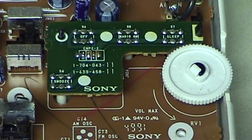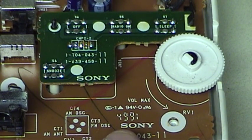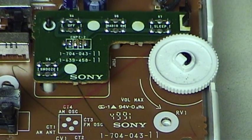You can also see a date code down here — that's the 4991. It tells us that this unit was made in the 49th week of 1991, meaning that this clock radio is probably either a late 1991 or 1992 model. Although Sony probably has the manual on their website available for download, I have not checked its copyright date to determine when this clock radio might have been marketed. Despite its age — clearly it's more than 20 years old at this point — you can see that it's still working pretty well, apart from some uneven brightness in the segments of the LED display that you saw earlier.